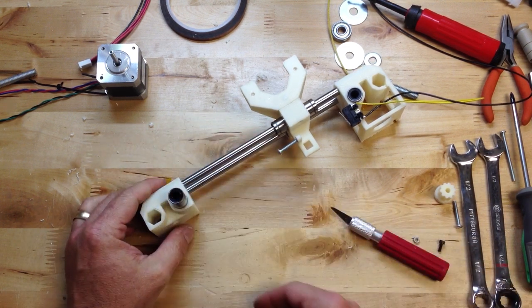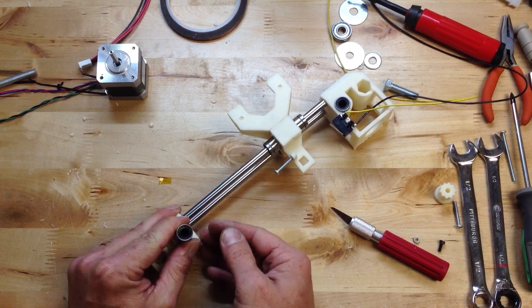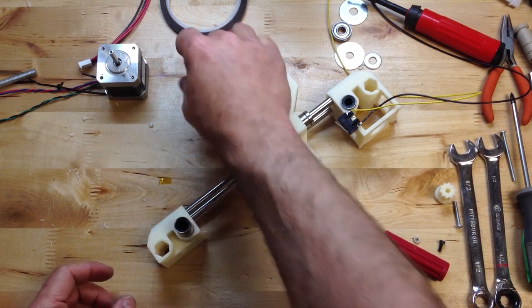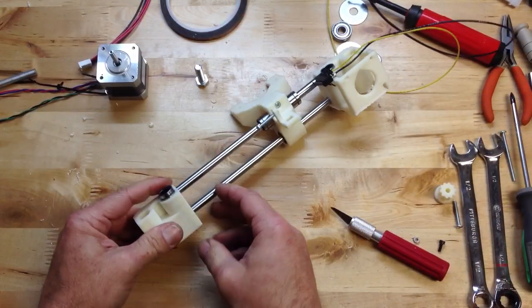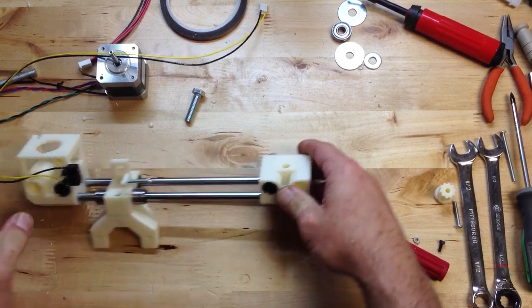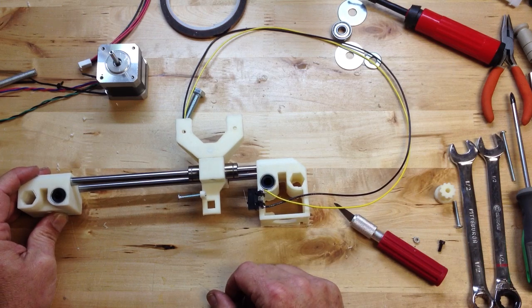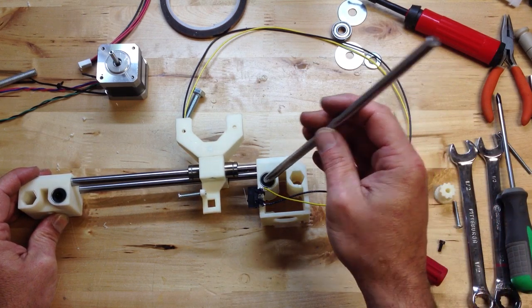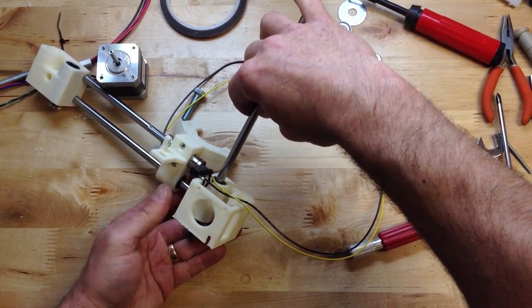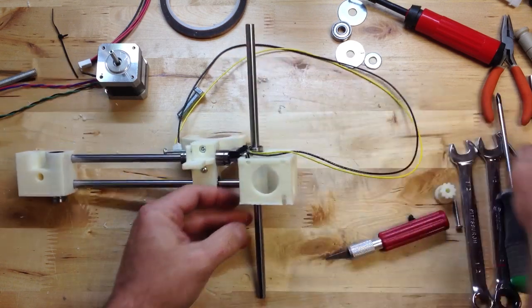Another technique on pressing these in: don't hammer them. Vice grips are bad — if you have anything that gives it an angle when it pushes down you can break your part. I sometimes put it on a drill press with a nut upside down like this and press it down. In this case that is like the perfect tightness right there — it gave me enough push back that it's going to be in there really tightly. So whether or not you have to wrap it in tape or squirt some glue in there, it'll work just fine. Now these will go in — there's two of them here so you want to be real careful not to kick out any bearings.